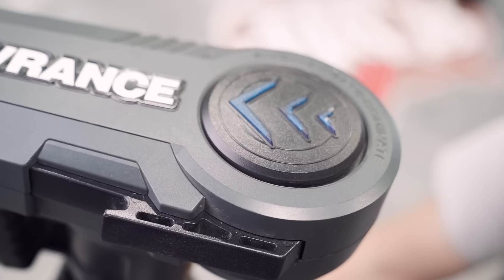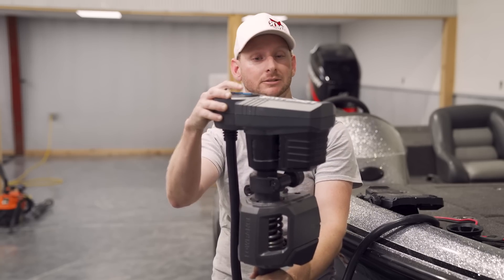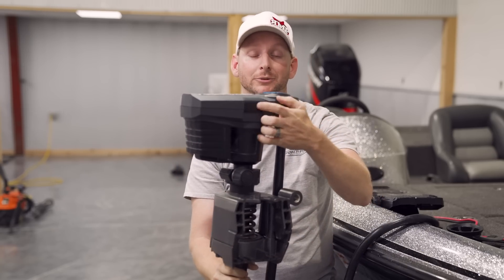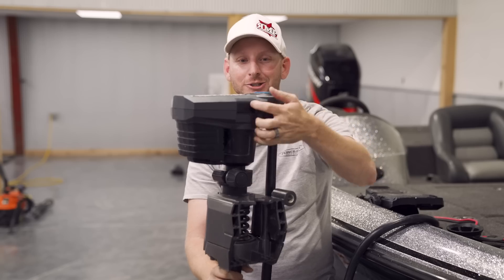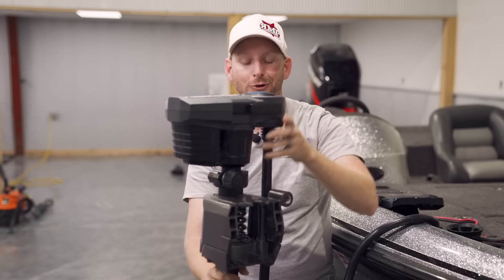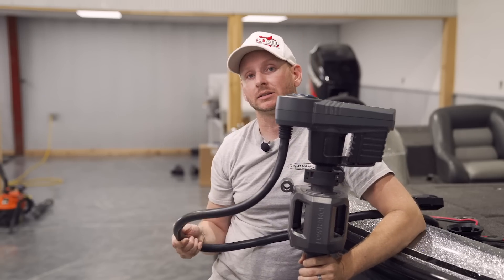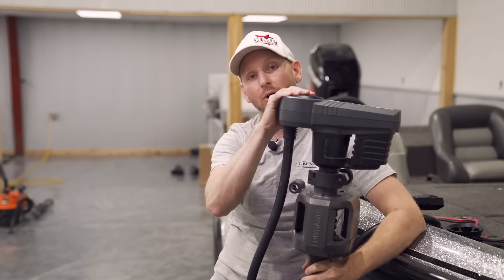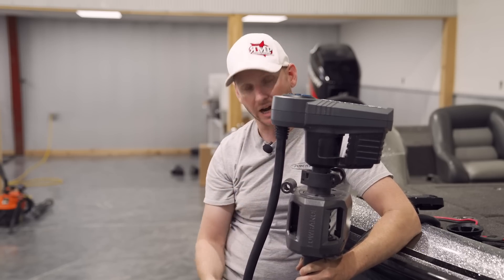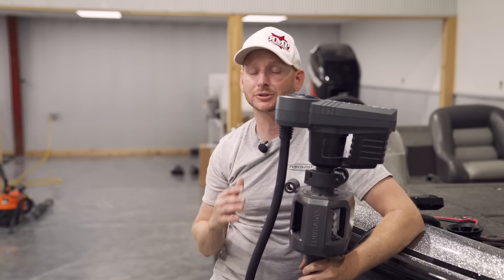There's a magnetic indicator up here that always shows which way you're going, with LED lights built in — pretty bright. There's also a really cool hook up here — check out our usage video to see what that's for. Big question: is it a cabled system? It's not. These do not have traditional cables. It's a fly-by-wire system with a stepper motor controlling the turning of the lower shaft. The lower shaft is all composite with a lifetime warranty to the original owner.